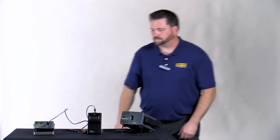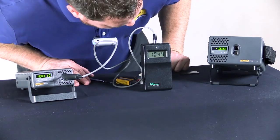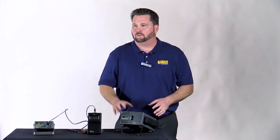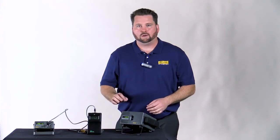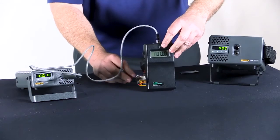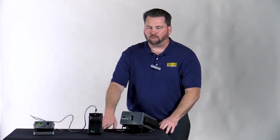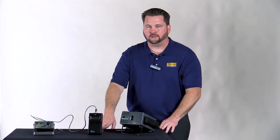I've moved right over to the 100-degree point — that's kind of where we left off. You can see here that from the boiling water to the dry well we're almost four degrees high. So we need to make an adjustment again — bringing it back down. I've made the high-side adjustment and pulled it back from roughly 104 degrees down to right at 100 degrees Celsius.